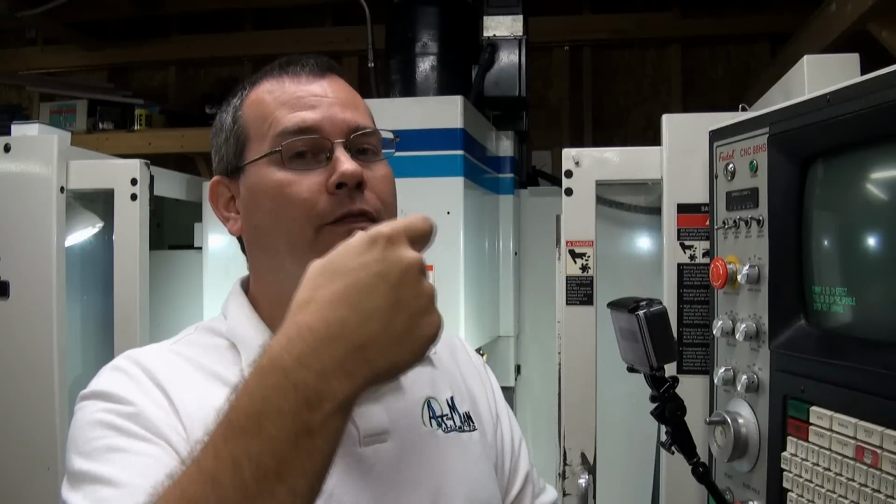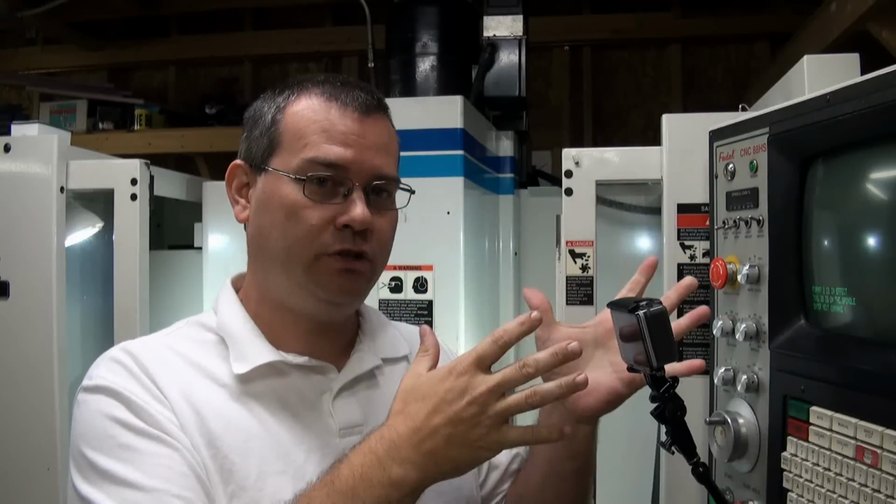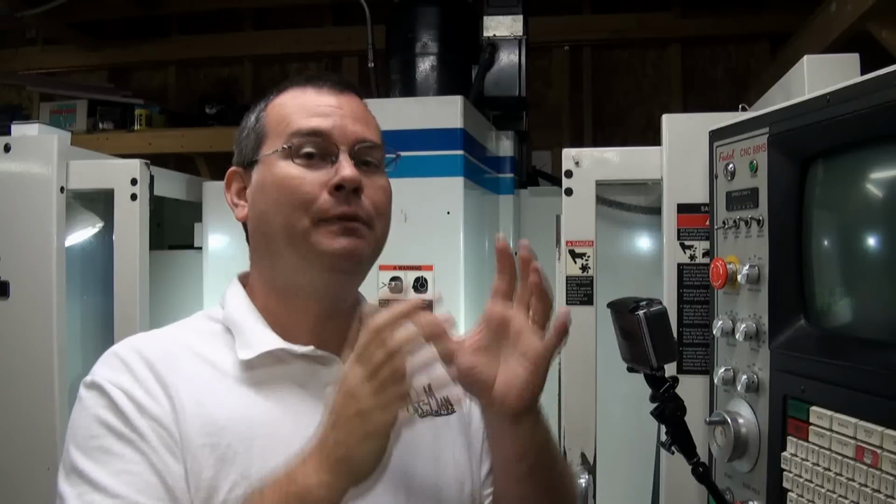The next line on the program must be an O and a number, and that will be the program number that the machine will store it in. And then when it sees another %, it will stop, and it will say, okay, program done.